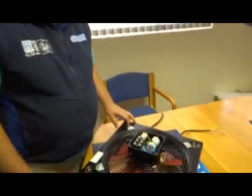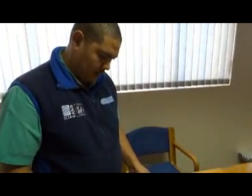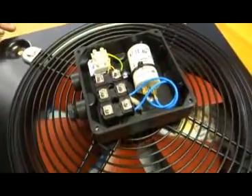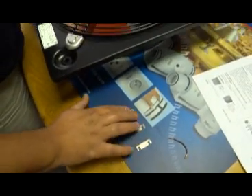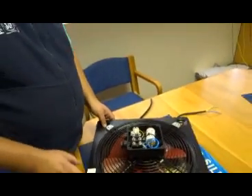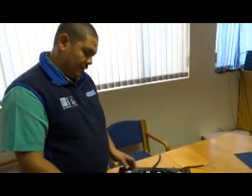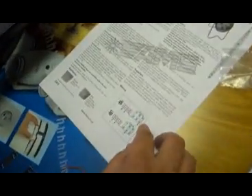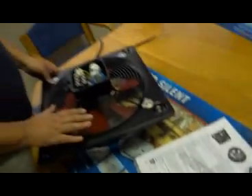We are busy with the wiring of the S&P HCFB fans single-phase. When you open the connection box, you will see that there is a set of three links provided in the box. This fan is standard Form A, so the Form A wiring diagram is the top one. The only time we use the Form B wiring is when your fan is fitted with a Form B blade.